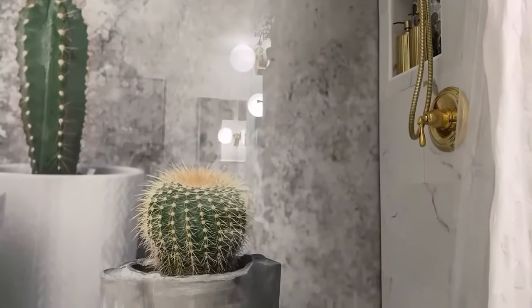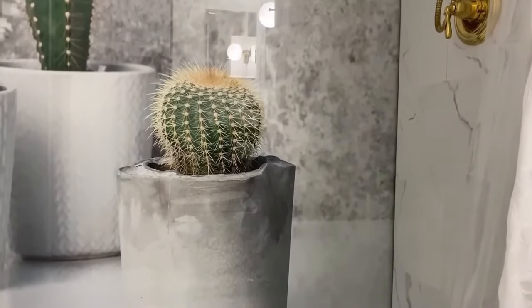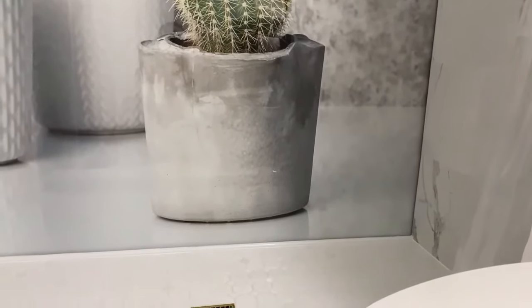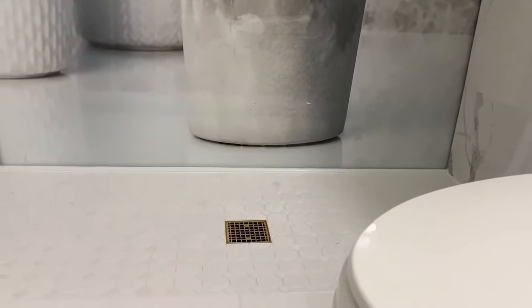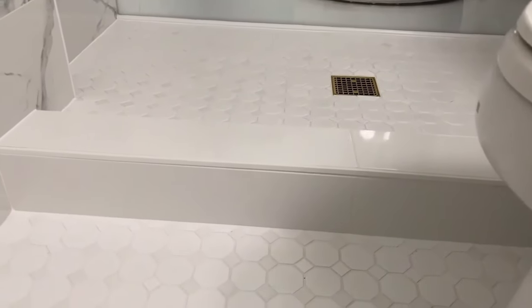Make sure that all four edges of the glass are airtight and watertight. Shower glass walls must have tempered glass. The glass must be sitting on a floor without movement, and the bottom edge of the glass must be sitting on padding.